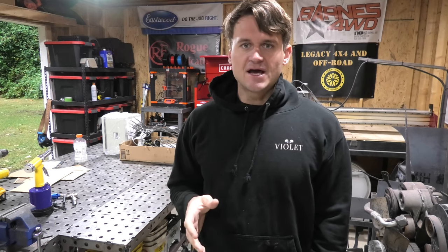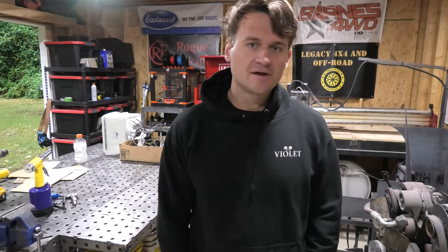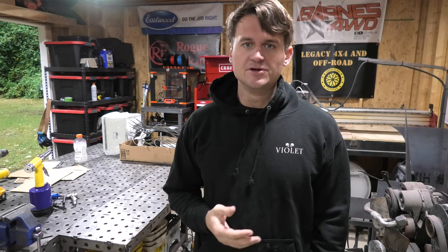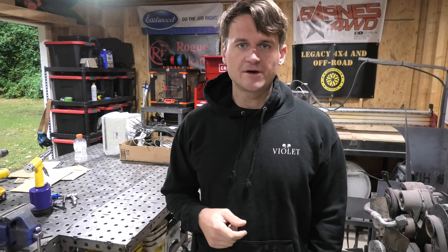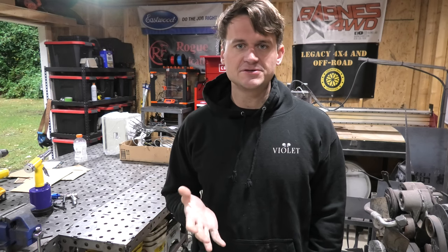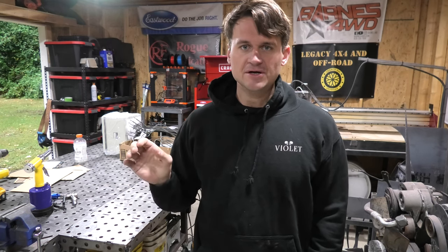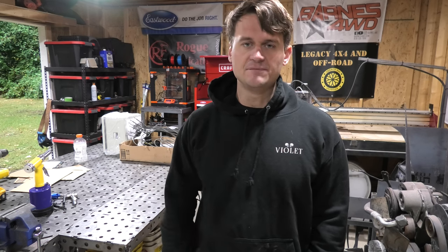I'm going to make these out of some 1/4 inch scrap that I have sitting on the sheet metal scrap stand that I have over there next to that 350. I'm going to do something really simple: use a plasma cutter by hand to cut out an outline real quick for the casters to mount to, and then make some really simple triangular gussets. I think that's going to be more than adequate, and then weld that fully into the side of the oven into where the 2x2 meat is, so it's got enough meat to grab onto.